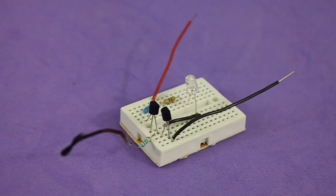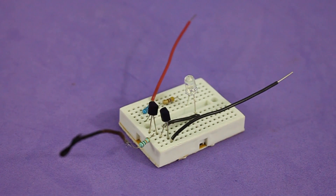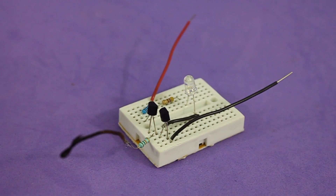And here's the circuit on breadboard, very easy to make. For the transistors I am using 2N2222A, but you can use practically any small signal NPN transistor. The sensor is a piece of copper wick, but you can also use any piece of copper wire.